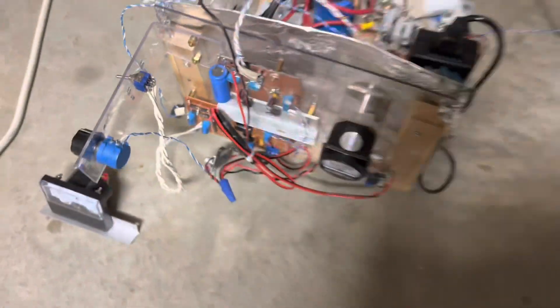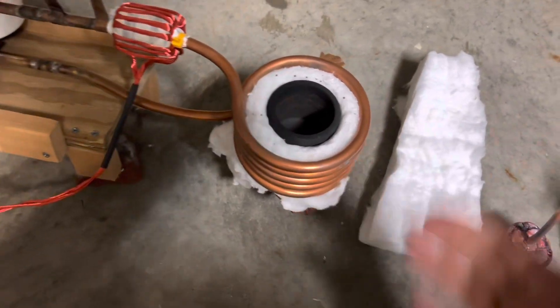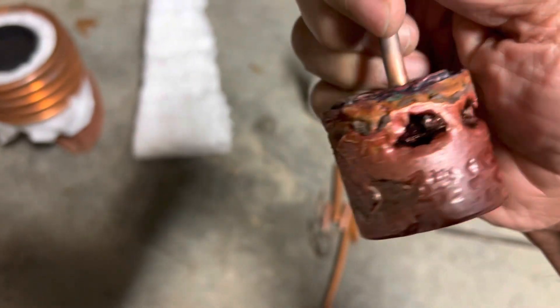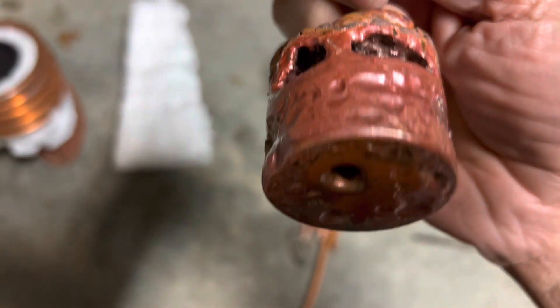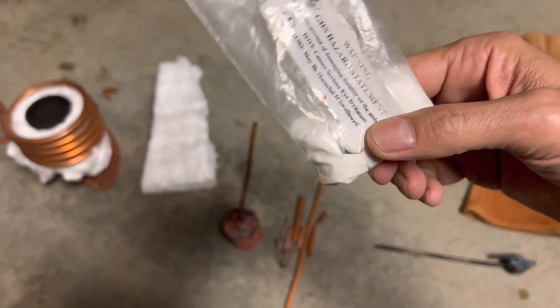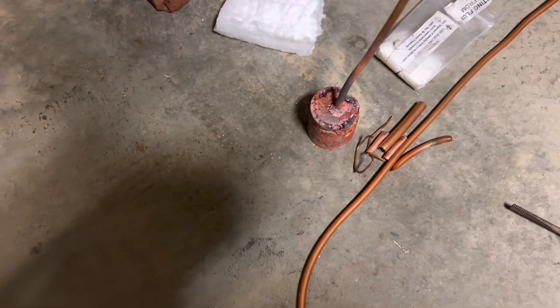We're going to activate the logic circuitry — there it goes. That also runs a water pump which pumps cold water through this big coil. Here's my hand for comparison. The scrap we're going to melt is this copper piping and this malformed slug of copper I melted before — it had a bunch of bubbles in it, so I'm going to remelt it. To help with our melting process, we're going to use borax, which reduces the copper oxide into copper metal, prevents oxidation, and helps the copper pieces coalesce together as they melt.